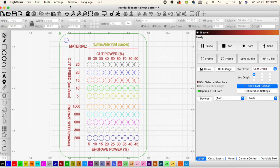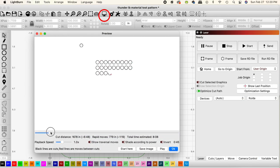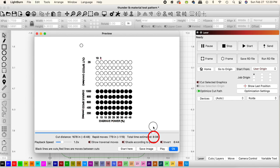Here are the last few steps. I know it seems like a lot to run a laser, but once you get the first one set up, everything can be done in less than two minutes. In Lightburn, go to the top tool panel and click the little computer screen icon. Your project will show up and you can preview how it's going to be cut and/or engraved — it will also tell you the total project time. This is a great feature because if there are any defects, skips, or anything like that, it's going to show up in the preview screen before you ruin any material.